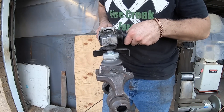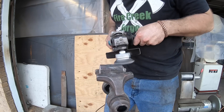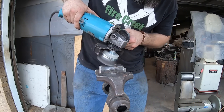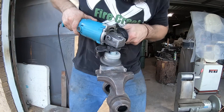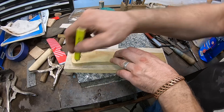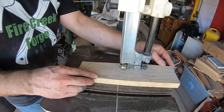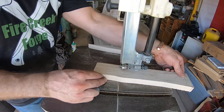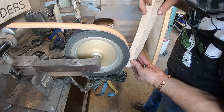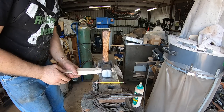Next I'm going to wire brush the surface of the hammer, bring out that nice forged finish, and get all the forged scale off. I'll be using a nice piece of hickory for the handle. I put shorter handles on my hammers to match the ergonomics — I don't typically grip my hammer way out on the handle. It kind of goes along with some ideas from the Yuri Hofi hammer style. I've used it a lot and it works pretty well.